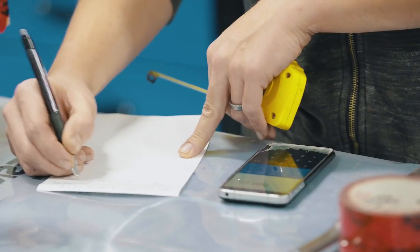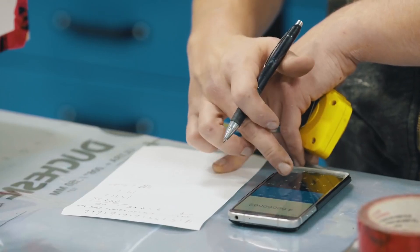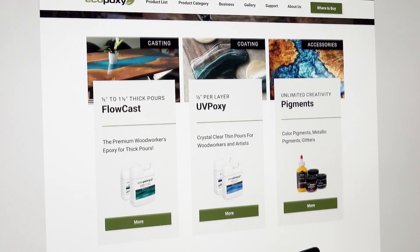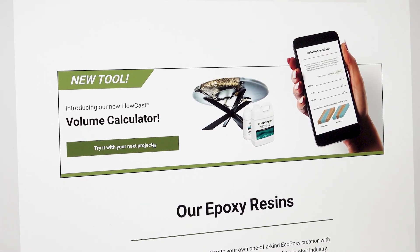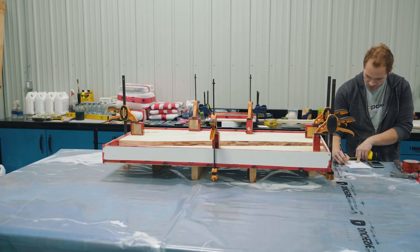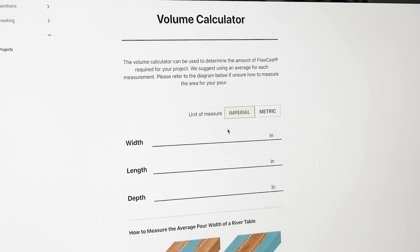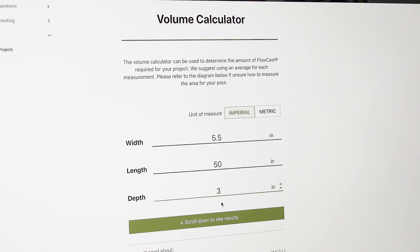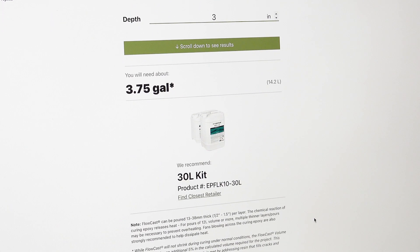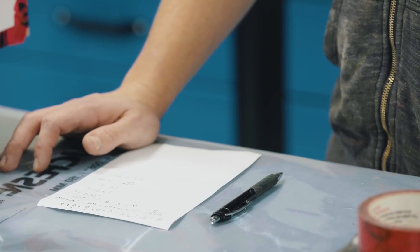The next step is to figure out how much resin you'll need. In the past, that meant figuring it out with a formula and a calculator, but now we can use the handy Flowcast volume calculator. The link is right there on the front page at ecopoxy.com. Just figure out the average gap between the slabs and enter that as your width, then enter your length and depth measurements and it'll tell you the volume of Flowcast you need in gallons or liters. In this instance, the average gap was 5.5 inches, the length was 50 inches, and the depth was 3 inches. Plugging that into the volume calculator gives us 3.75 gallons or 14.2 liters. We always round up to ensure we have enough product, so for this table we ended up using 15 liters of Flowcast.